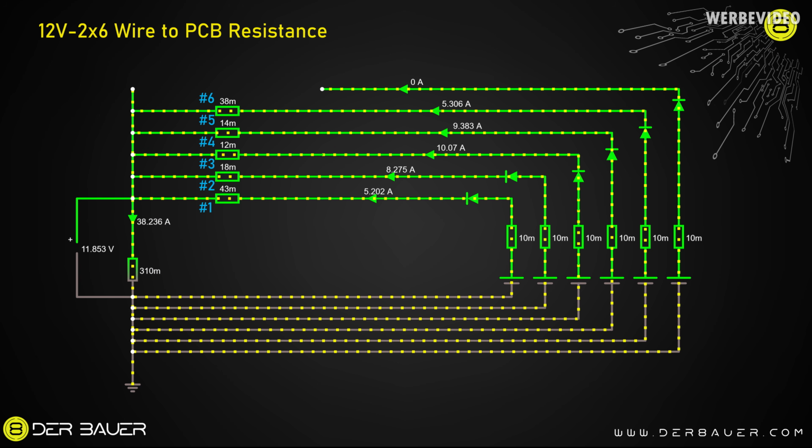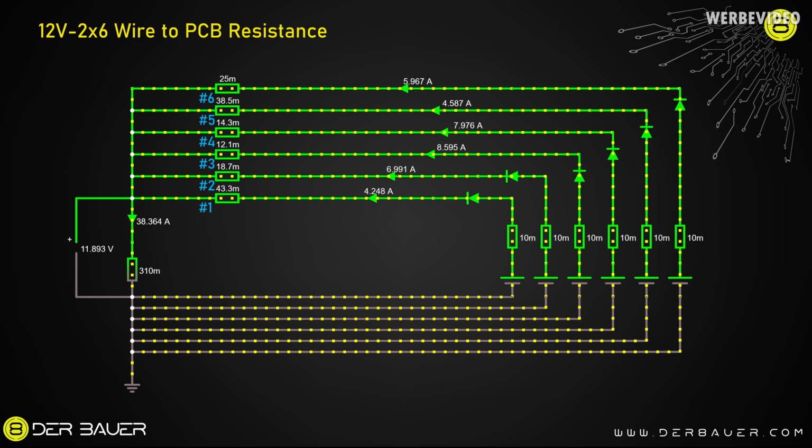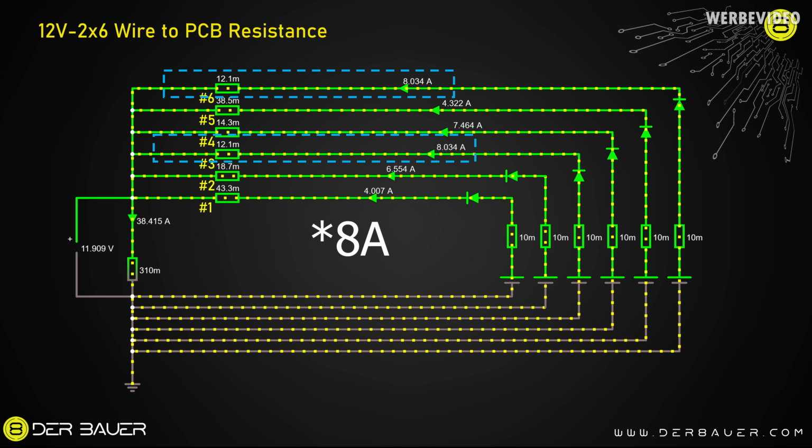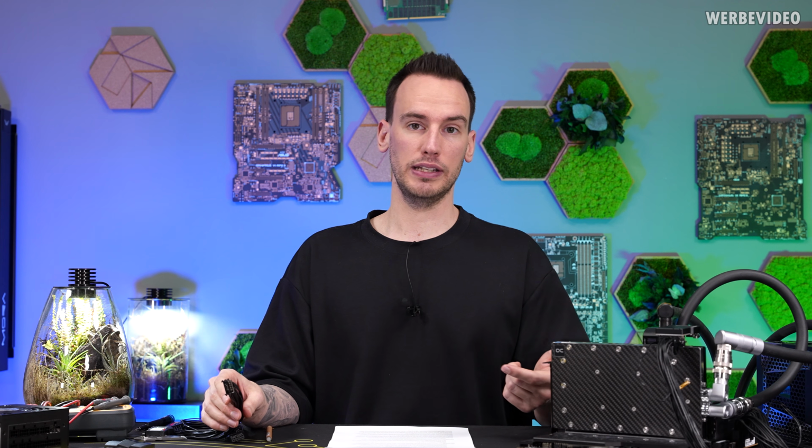I thought of looking at two different cases. One would be with a rather high resistance of 25 milliohms. In this case, the wire would have carried 6 amps, which is at least for the wire still in the specification. If we go down as low as 12 milliohm, which we measured on pin 3, then both pin 3 and pin 6 would both carry 6 amps. And now with this current and the resistances, we can calculate what kind of power draw and thus heat we are generating inside the connector.